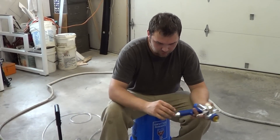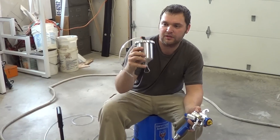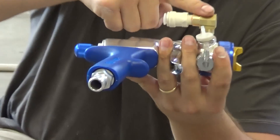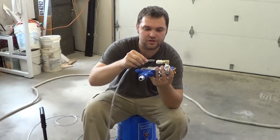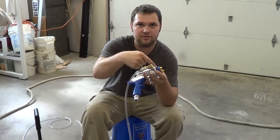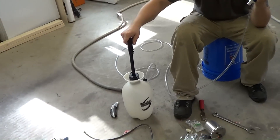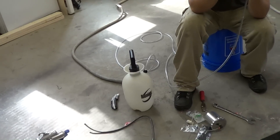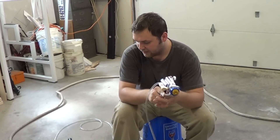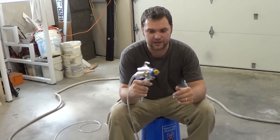What we did here is we've taken the can — this is a very small one, so we ran out of dip pretty quickly with this one. What we did is we took that out, put a 45 degree angle here and hooked up a quick connect for a quarter inch outside diameter and hooked it up in here. That line will feed the paint into the gun, and then we'll hook up the air hose from a turbine to feed the air. Then we can pump this up and use that pressure to push up to the gun, which will work fantastically so that we don't have to refill the gun so many times and we don't have to carry anything on our back. The can will stand aside and you can just flawlessly and freely work on painting without tiring as fast.